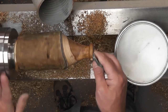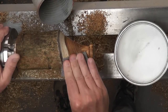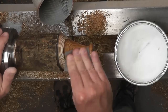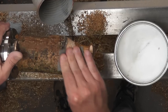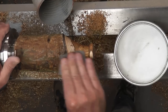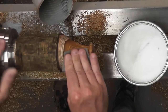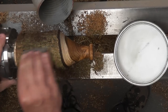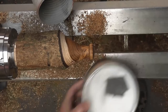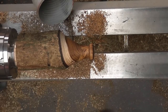Remember, your sanding sealer is a preparation for a finish. It's not a finish. So it does need to be covered. We're going to use this lovely wax. And with the wax, we'll just buff it off. So again, ideally, you want to leave it 5-10 minutes. Buff it off, but we're not going to. We're going to go straight into it. You could wax this surface if you want to. Again, it'll just bring it out and be a lovely satiny finish as opposed to the matte that we've got. We're going to go with some fresh dry tissue.